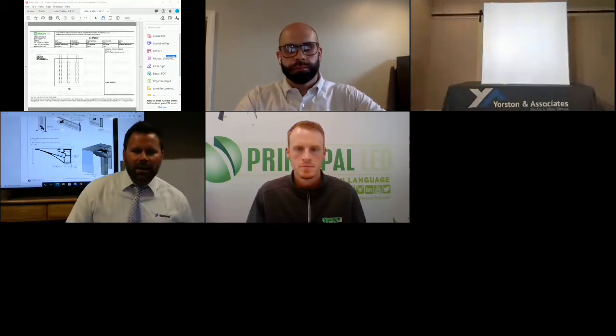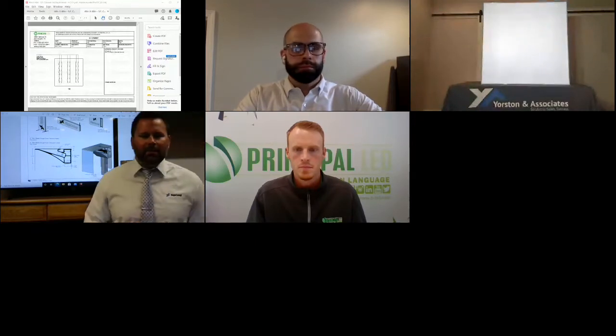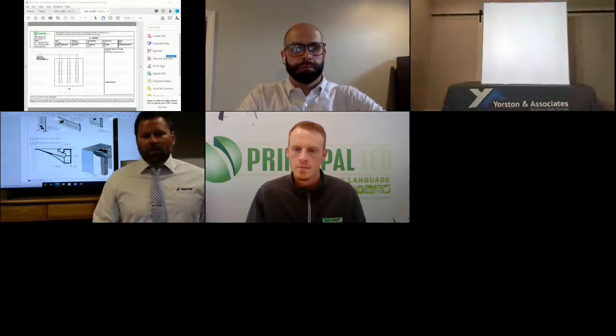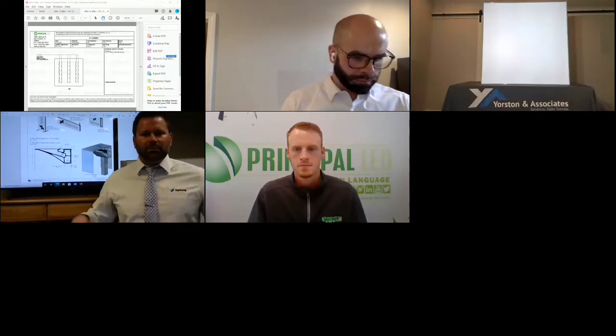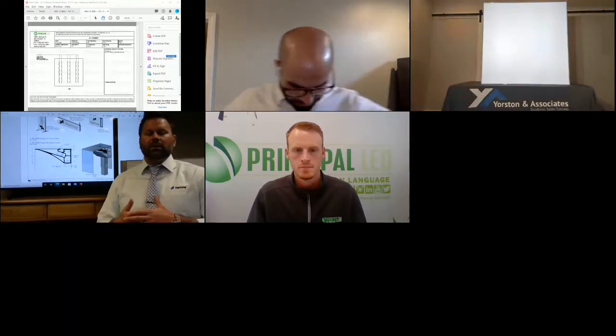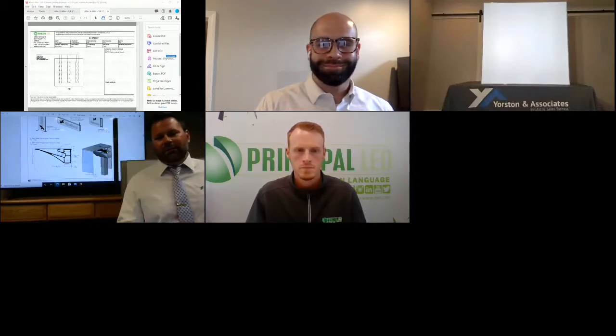But with that as well, Colleen, we have three different frame supports. If you have a deeper cabinet, we have the extended frame brace. That is a two-part setup that kicks you deeper into the cabinet. Because with LEDs now, we're trying to get as close as possible to that light source. Before, we could still be only 3 inches away from the face with the lamps, and we had no problems. But with the beams nowadays, we're trying to get as close as possible so the beams can get around that frame brace before it hits the face. So we're just trying to make sure there's enough time, as well as SignComp trying to get out of the way. So there are three different types of braces.